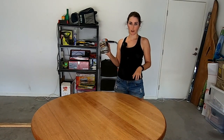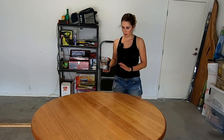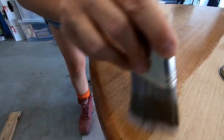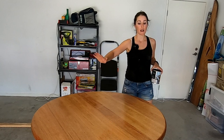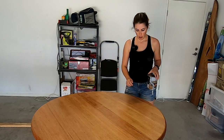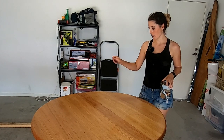I've done the first coat of varnish. Another downside to using turpentine-based varnish is the six-hour drying time. Water-based ones are thinner, not as sticky and tacky, so they dry out much faster. But you can see already it's a beautiful finish - it's looking really lovely. As with sanding, when brushing, brush with the grain so you won't see any streaky marks at the end. Before your second coat you could lightly sand with fine grit sandpaper, or just apply the second coat. Because my surface is already really good, I'm just going to give it a second coat in a few hours.